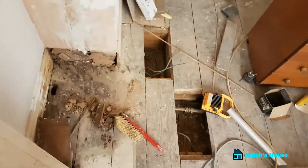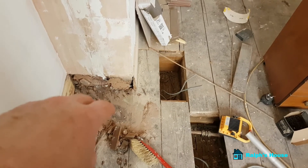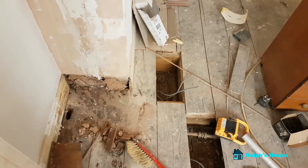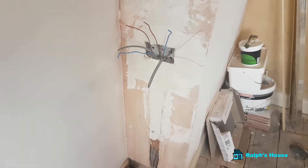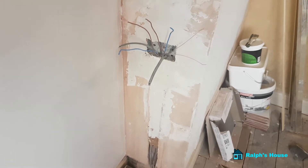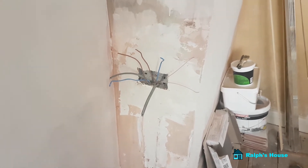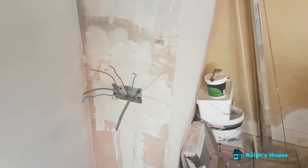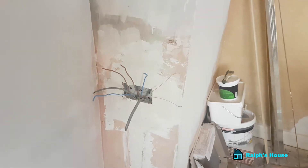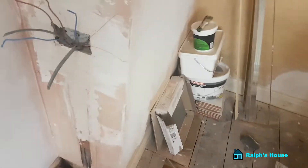That's all been finishing plaster — in a couple of days I'll be able to come back and sand that. Same there. I've also got the extra challenge of replacing the skirting board; there was a big chunk missing. I've built the bottom of the wall up so I've got enough to stick with No More Nails, then fill afterwards. Now, normally most electricians use 35mm deep boxes, so you're not cramming everything in, but because these bricks are so hard to chisel I'm down to 25mm, which is a little tight. I do have to manoeuvre the cables around inside so everything fits and it screws up.